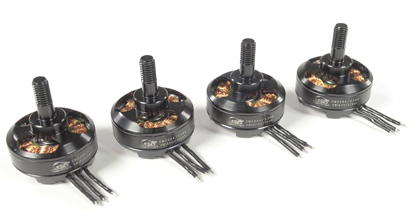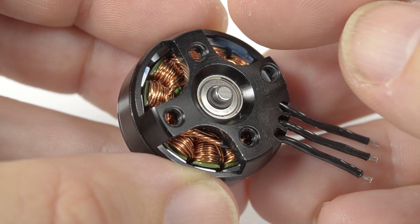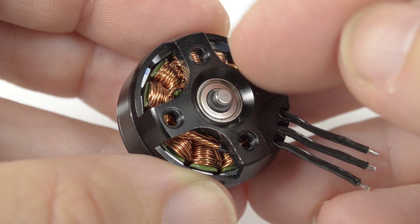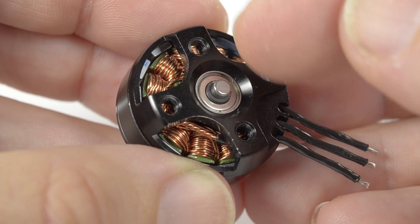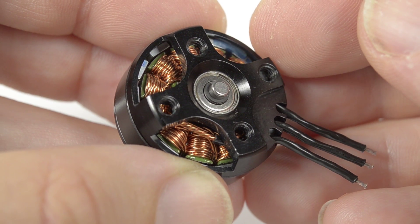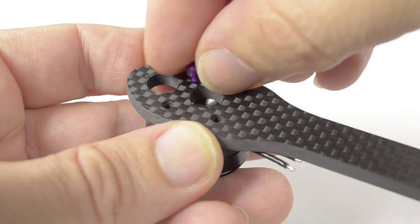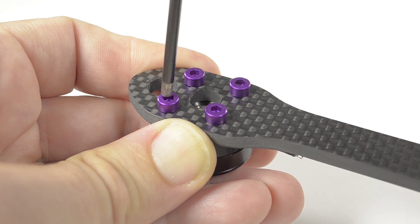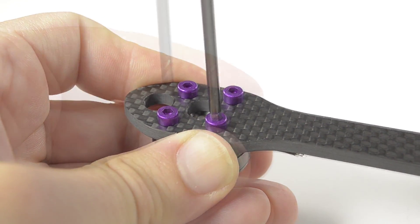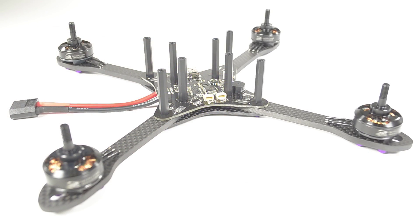Take your four prepped motors and the 16 M3x6 motor screws. You can mount the motors with only two screws per motor if you wish, for a total of eight. If you do choose to mount with only two screws, I prefer the 16mm centers because it's closer to the hub that supports the base of the motor — that is what the stator joins to. Although it seems counter-intuitive, the 19mm gives a wider stance further out from the strength of that hub. Mount the motors to the arms, screwing each screw just firm until all screws have reached the base, then following a pattern from one across to the other side. Repeat that pattern, tightening only a little each time until fully tight. Mount all four motors.